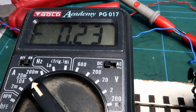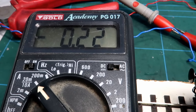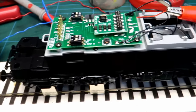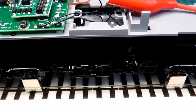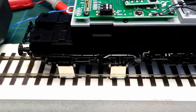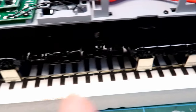There we are — it's answered it for you. It was only a quick blip up to 400 milliamps. That's way too much. So either it's a problem with the motor, or it's a mechanical obstruction in the gear train.